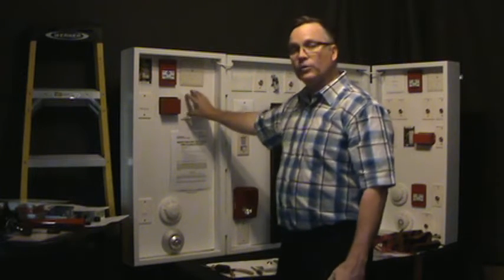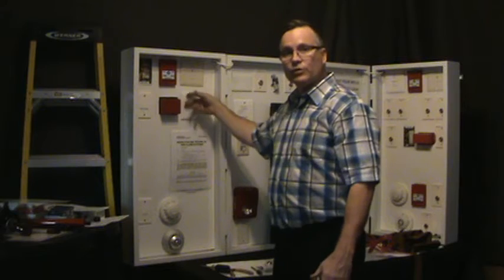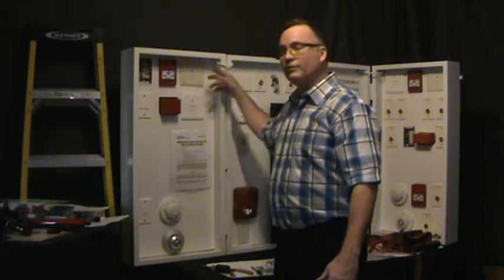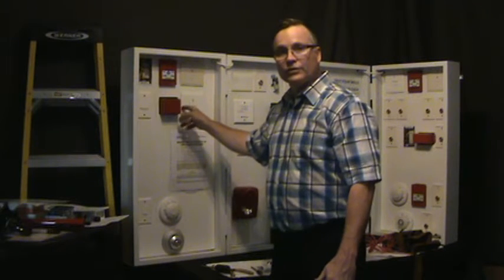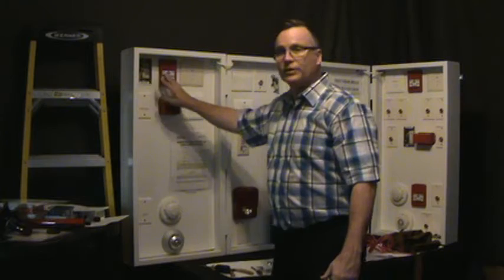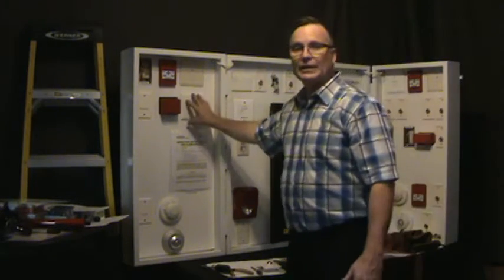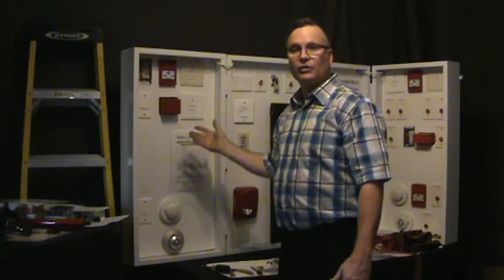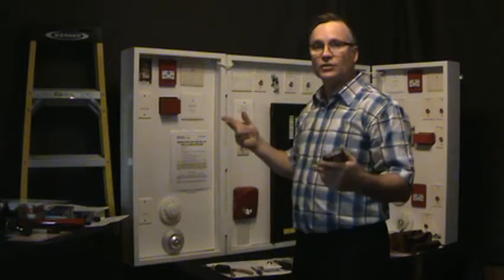Now you go to the other one, which is the isolator out, and again you take the wires coming from that to the panel, do an open, and verify that it works in the opposite direction. Then you short the other side, test the device on here, verify that this does not work, and test on the outside of it. It should work. Put this back together and your test is done. This has to be done for every isolator. Every floor in and out has 2.